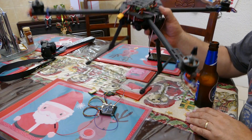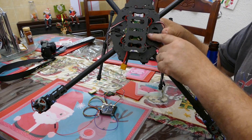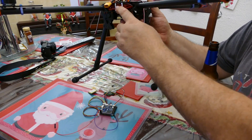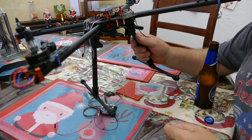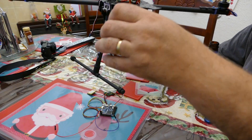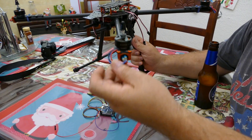I haven't done a real lot to it yet, but so far I've managed to put in a power distribution board — which is under there — and all the ESCs, electronic speed controllers, 30 amp, are in there. There's four of them, one for each motor. I've mounted the motors to the ends of the arms. I haven't finished tucking these wires in yet.